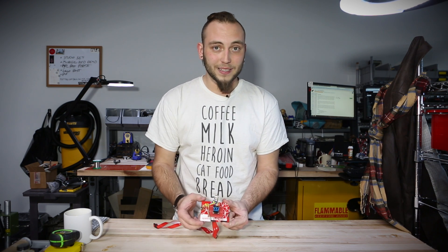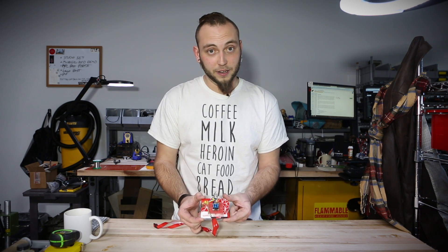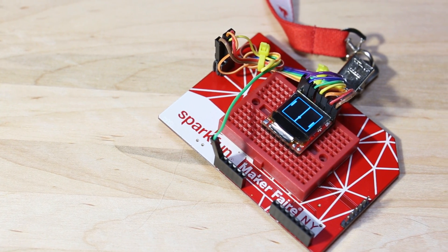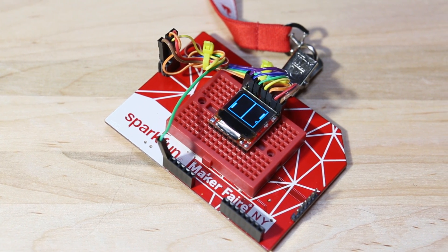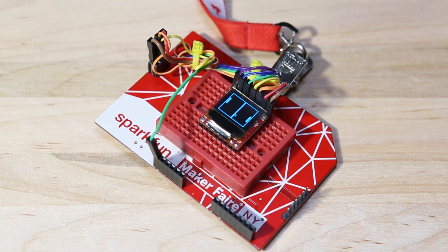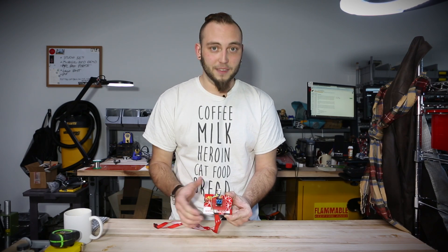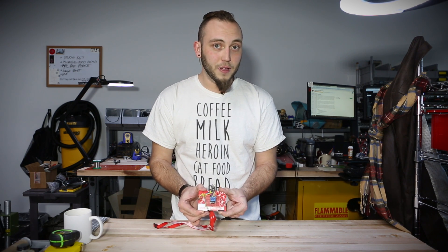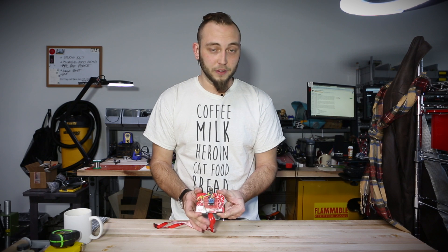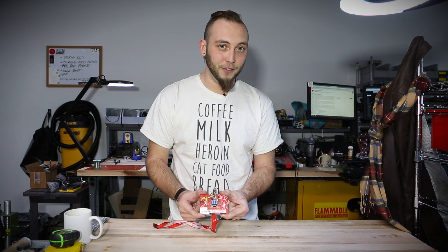It's basically just an Arduino Pro Mini running at 3.3 volts and I've hooked it up according to the hookup guide for the OLED breakout, which you can find on the product page. It's running a little piece of example code right now that just plays Pong, randomly moving the paddles back and forth and then stopping every time one of the paddles misses the ball. You could easily modify this code to make it a playable game of Pong, and the nice thing about these screens is that even though they're small they're deceptively high in resolution, so you can pack quite a bit of text on there if you have to.